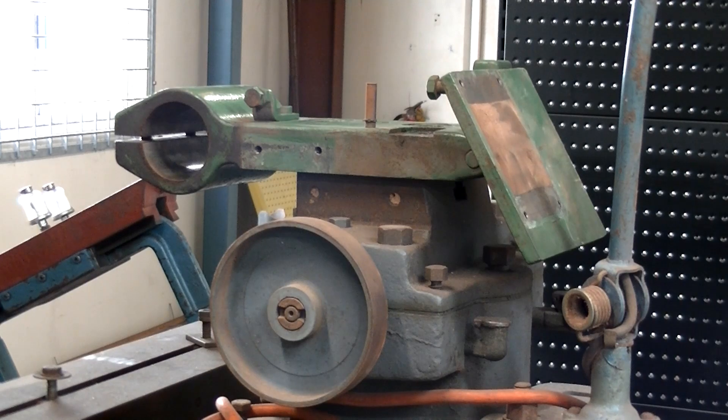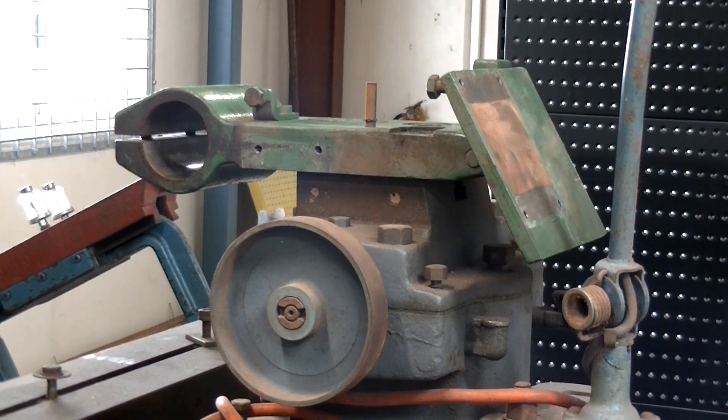I think it'll be a real good goer, and this would be a much better design than trying to rewind the motor and fully rewire all of the horrible electrics — it's still 1940s edition most of it. Outside of the frame it's okay, but inside are still all the original conduited rubber and cotton wiring, and that makes me shudder when you're talking about 415 volts. Okay, we'll put a few things up on the table in a few minutes, but this is virtually the end of the first section. Bye for now — please like and subscribe.